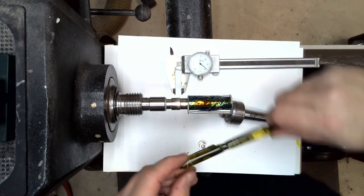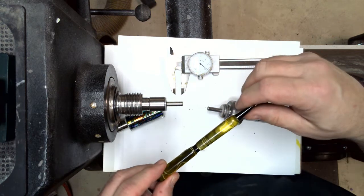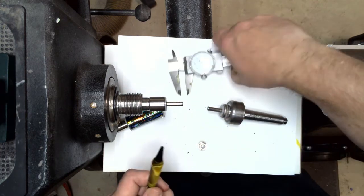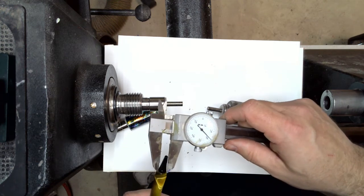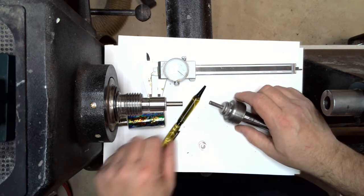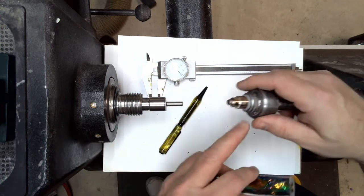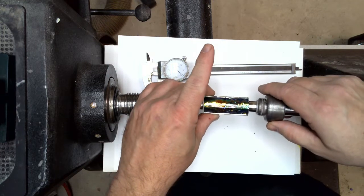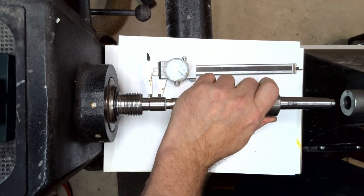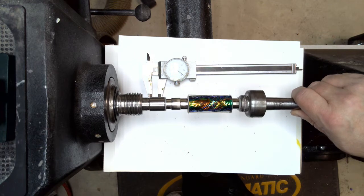Another thing I find is that in all my pens, as I've mentioned in other videos, I like to do a little bit of sculpting — my pens are tapered in, tapered out, with some sort of pattern. It would be really hard to micrometer that because I'd be micrometering where I want the pen blank to end, not necessarily where it is ending. So the easiest and most cost-effective setup is using this turn-between-centers system. Invest in the nylon washer — you're not going to go wrong with it — and you'll find you never have to worry about deflection or out-of-round.